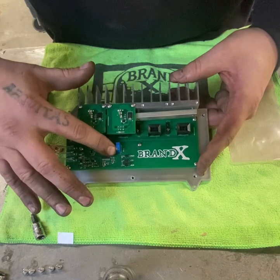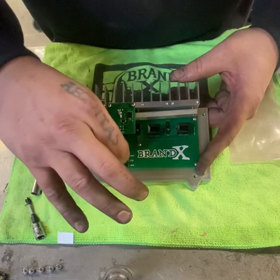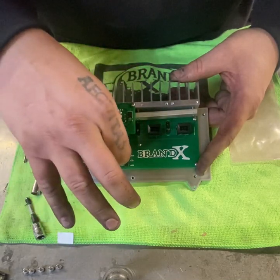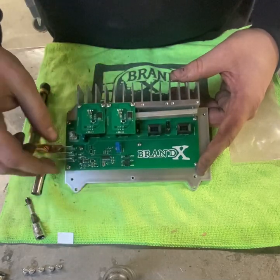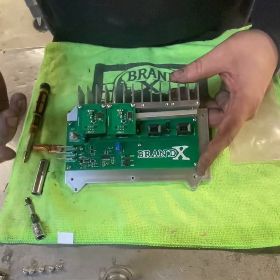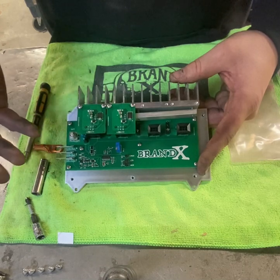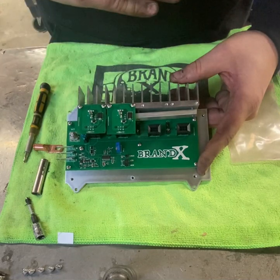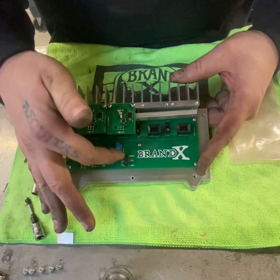For fine-tune adjustment, there is also a set screw here on a potentiometer that'll allow you to adjust the voltage exactly. The fine-tune is not very sensitive, so you do need to turn it quite a bit to get any kind of adjustment — we did that mostly for vibration resistance. That's the purpose of the jumpers: if you're familiar with external regulators, one of the main problems is voltage fluctuation from having a knob as the sole adjustment, and this eliminates that issue.